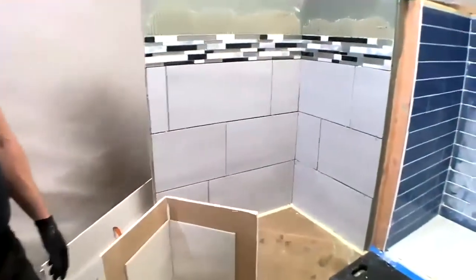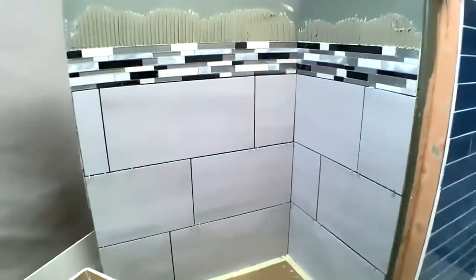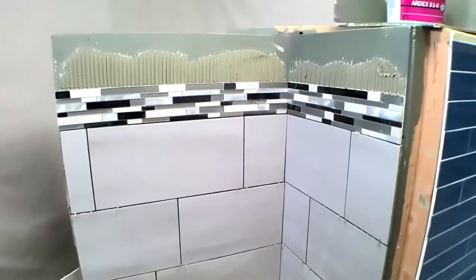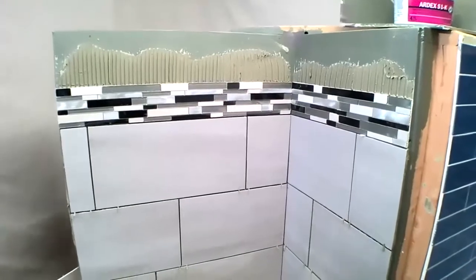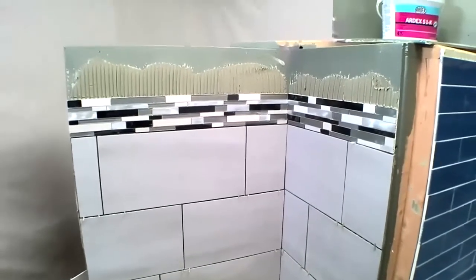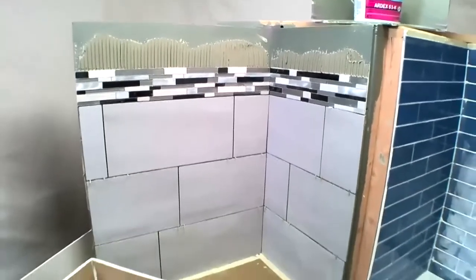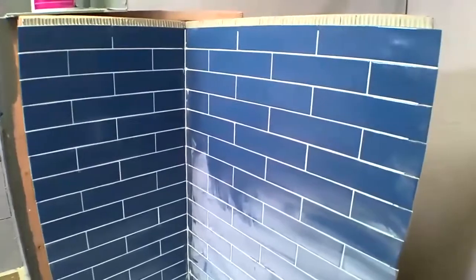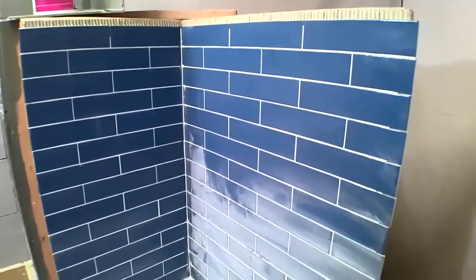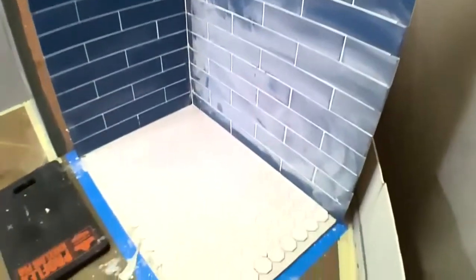Lastly, we'll show our installation today here with X77. We talked about SK175 for pre-mounting glass mosaics. And you can see that everything is held still. It's installed very quickly and nice. Now we'll clean this up. We'll offer the opportunity for people to see this on social media later on after we're all cleaned up here. But we used FGC on this wall. We'll finish cleaning that up once we wrap up.